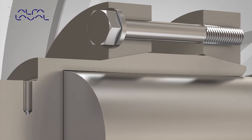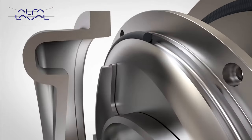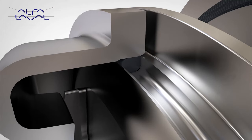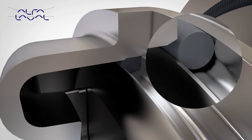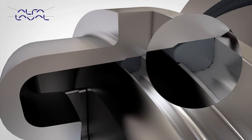The LKH pump features defined compression O-rings throughout. Metal-to-metal contact ensures defined compression, controlling O-ring deformation, ensuring a crevice-free design while profiling it to the liquid interface. This provides a hygienic sealing solution, thus reducing process contamination risk and cleaning cost.